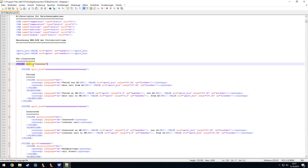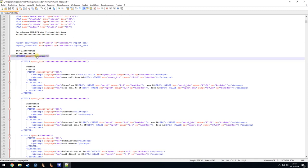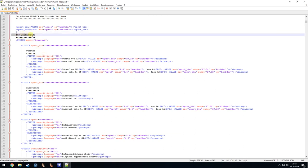There is, for once, the A protocol, or the A protocol bin. The A protocol itself are the hex values, and we have here 8 hex values. That is the long protocol with 4 bytes, or we have the whole thing in binary, because sometimes only one bit is important for what is happening. And here directly we can see if a 0 is at the beginning and every other value is not important, then we know, okay, it's an internal or an external call or something with calling. And if now the 7th bit at the end is a 0, we know, okay, that must be a door call